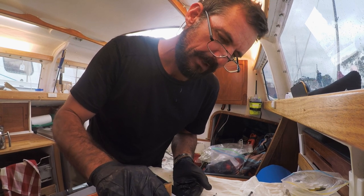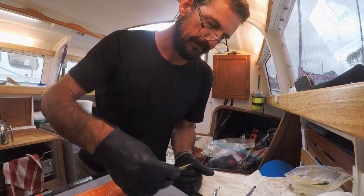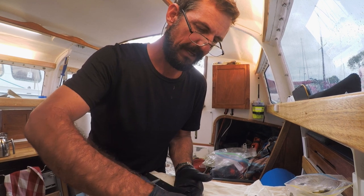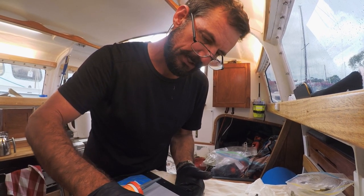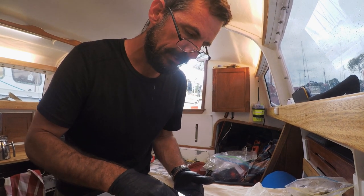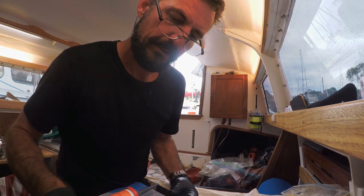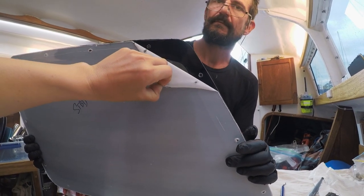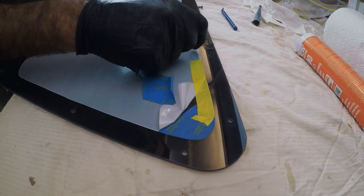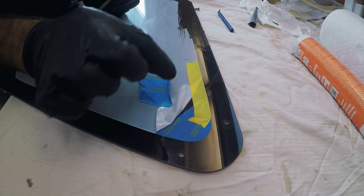To stick this window on it's going to need a couple of millimeters thickness of Fixtech to account for the expansion of the polycarbonate. This stuff can also be used to just stick windows into boats without fasteners, but I wouldn't be fully happy with that. Before we do that we want a thin coat spread really evenly — on the other side what we'll see is just a solid black, so we're actually using it like a blackout paint. This layer we're putting on now is not the final layer, it's very very thin. I've peeled the corner back and put masking tape so that once this is covered in Fixtech, I'll be able to get my fingers in and peel it off later on.